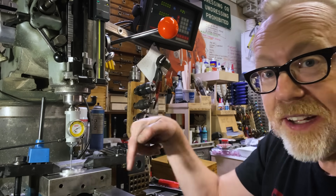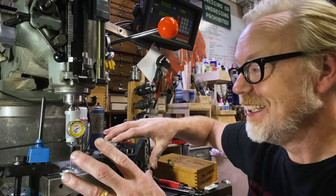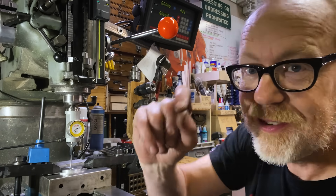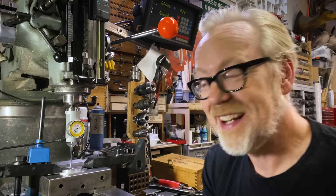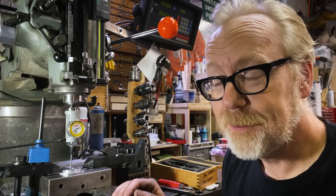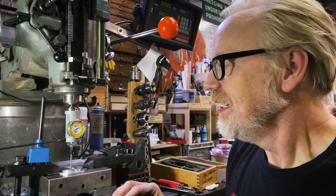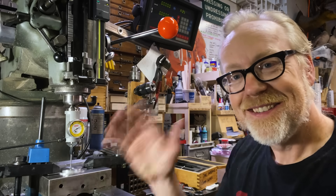You can also measure the outside of a hole — I could have centered on the outside of this. All the different probes that are part of the Wiggler allow you the ability to basically center on any kind of circle: interior or exterior, from super tiny — literally like a punch point — all the way to probably something about this big in diameter. These cost a few hundred bucks — they're not cheap, maybe a couple hundred bucks. However, I use this thing almost weekly, and when you get pretty good at it, the setup is not as laborious as it may have seemed in this video. That's a Wiggler, and that's how you center your machine above a hole. Thanks for joining me for this tool tip — I'll see you guys next time.